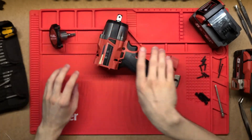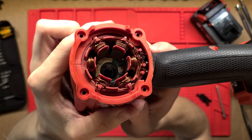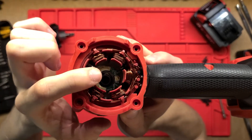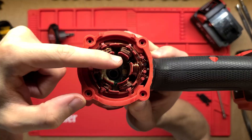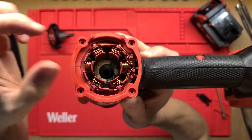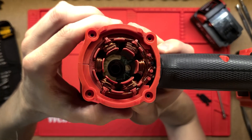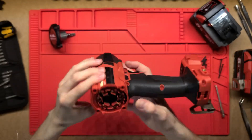We'll set that aside and before I open it up we can just have a look inside the stator of the motor. We've got all these coils — it's a three-phase motor so we've got six coils connected in opposing pairs, so this one here and this one here would fire at the same time to pull that rotor all the way around. And down the bottom in that recess there we can see there'll be a bunch of hall effect sensors — probably a little bit hard to see, but we'll open this up and have a better look.